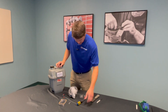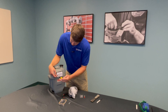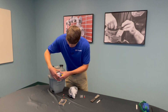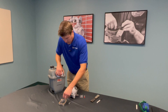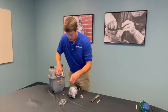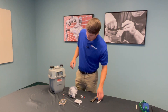The next thing we'll do is take the existing index out of the meter with the two small mounting screws. You don't need to worry about saving any of the hardware — screws, rock seals, or anything like that. What I do like to do, especially if you're working in the field, is put those screws in the index cover. We are going to use this existing index in the smart point here in just a moment.